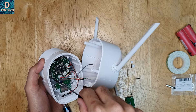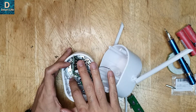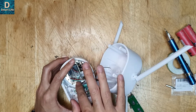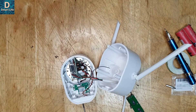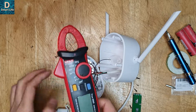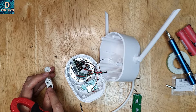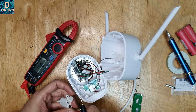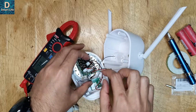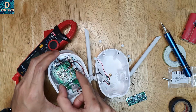After taking out some of the circuitry, we can see how it works. We need to disconnect some connectors. There are two connections on the upper board and two on the lower board. I think the red and black wires are the power supply, and the green and white-green wires are for the reset button. I'll check that using a continuity tester. Yes — the red and black wires are confirmed as the power supply cables. We may have to cut some of the cables.